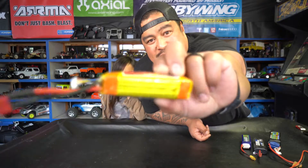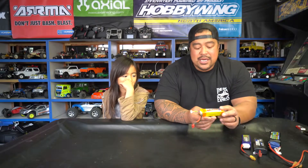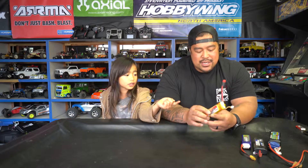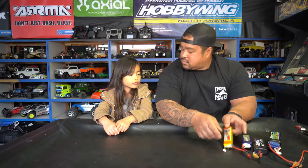Hey guys, Adam Lee RC here with my daughter Taylor Ahulani. Today we're talking batteries. Does anybody have batteries at home all puffed up? Not safe — I've wasted a lot of money. Batteries that are all puffed up are not safe. What I've learned is: put your batteries in storage mode. Don't leave them fully charged or at a low charge, because that's when they're most vulnerable to catching fire. I found that when I left my batteries charged a lot, they puffed up.